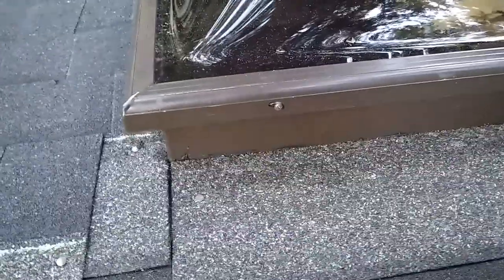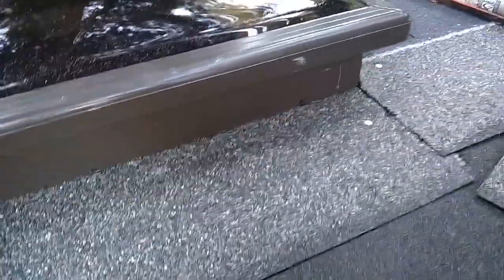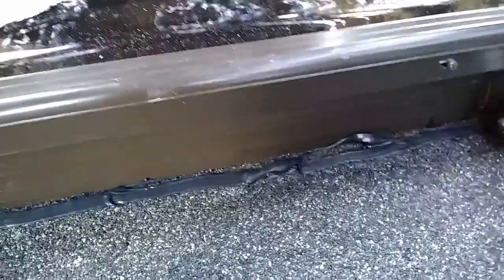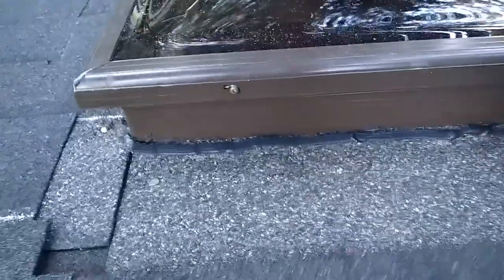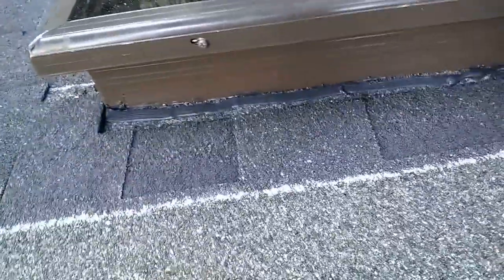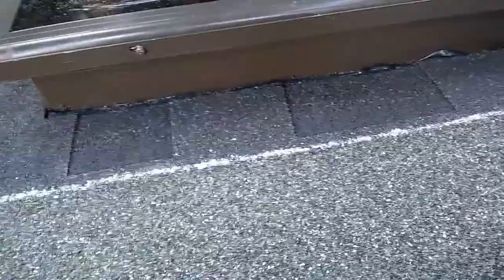The shingle that's going to cover the top of this skylight — I'm going to put a layer of sealant underneath the top, inside of the shingle, and on the sides, and then on top to secure it so that water will bounce off and go around. I'll slide him in — no pun intended. Obviously I cut him to size. And then you'll see the caulk flowing out — no pun intended.